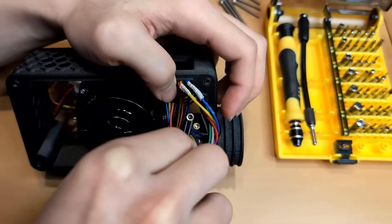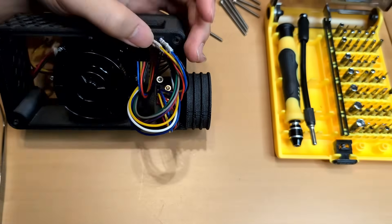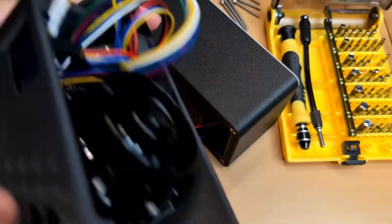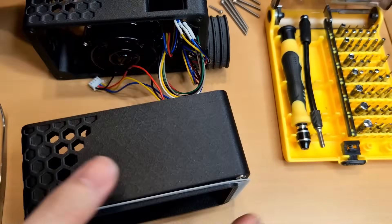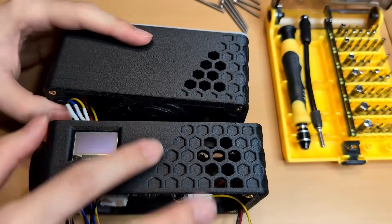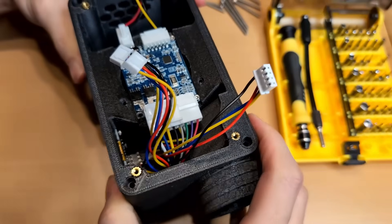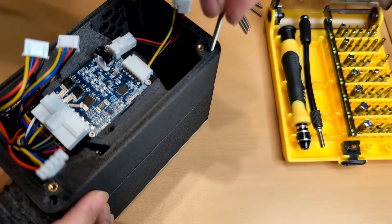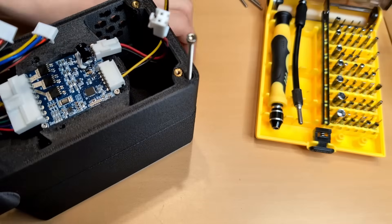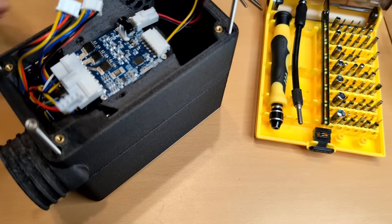The wires here connect to the inlet sensors. I used small magnets with pogo pins at the center to transmit power and data between the lower and upper sections. These wires run through the display housings and plug directly into the main PCB. This section also has a fan fixture secured with four corner screws, keeping everything aligned and sandwiching the fan tightly between components.